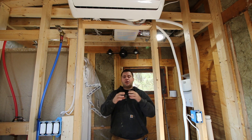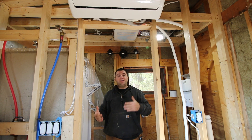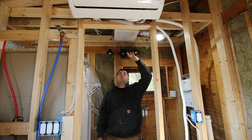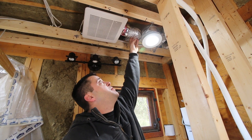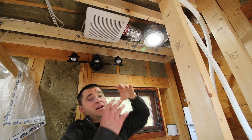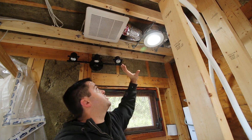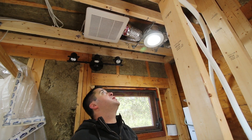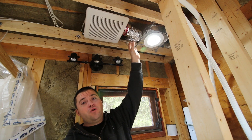When you're doing your research on these fans, they go by cubic feet per minute — how much air it sucks out in a minute. This one does about 80 cubic feet per minute. I went a little bigger than what I needed, and it's also really hard to find a bathroom exhaust fan under 80 CFM. It's the 0.3 Sone, 80 CFM, Energy Star model 7131-01, with four-star reviews. It's connected into some flex pipe here using a four-inch hose clamp, and I also connected it to the vent going toward the outside. I used very sticky tape to seal it completely so if the clamp fails, the tape will hold it and give it a better seal over time.